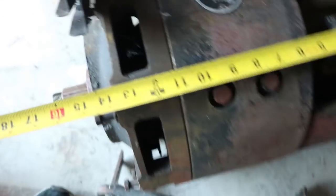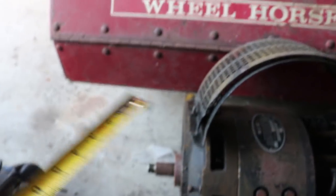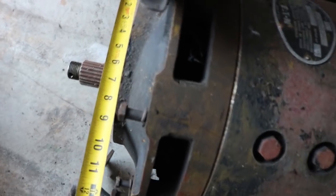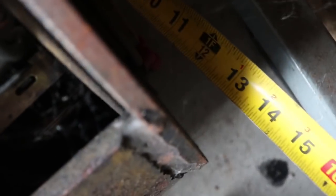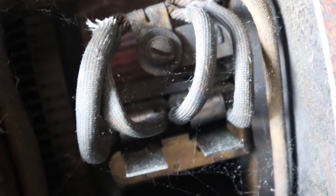The main body of this is about 14 inches across and the actual diameter is about 12 inches. It looks like it's a series wound motor. There are some big brushes over here with multiple conductors going to them — doubled brushes actually — and a nice big commutator.